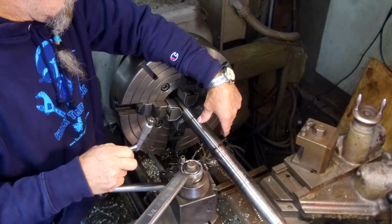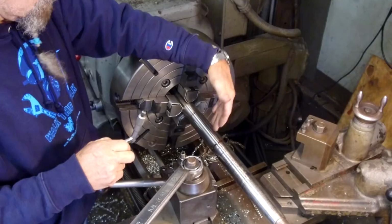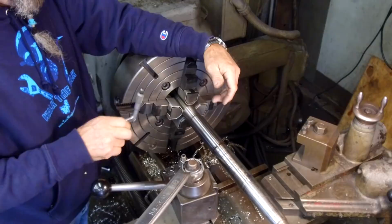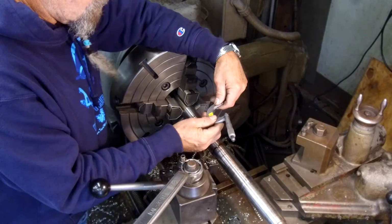We also did the weld fusion overlay process, which is bonding the proper materials to blend in with the original material. And this is 100% solid. There is no bond here. It's weld material joining base material with no problems of breaking loose at all. And so this is my number one go-to way to remedy a worn out shaft.